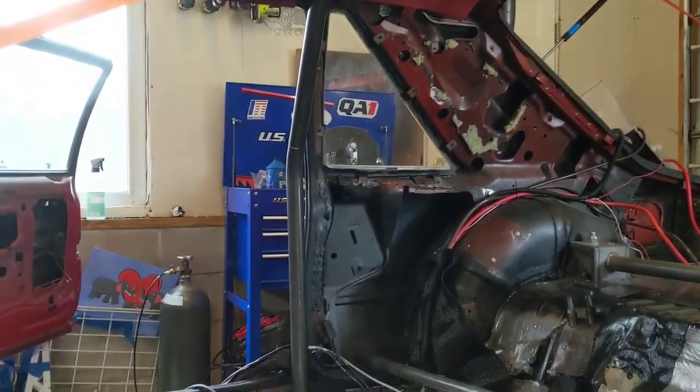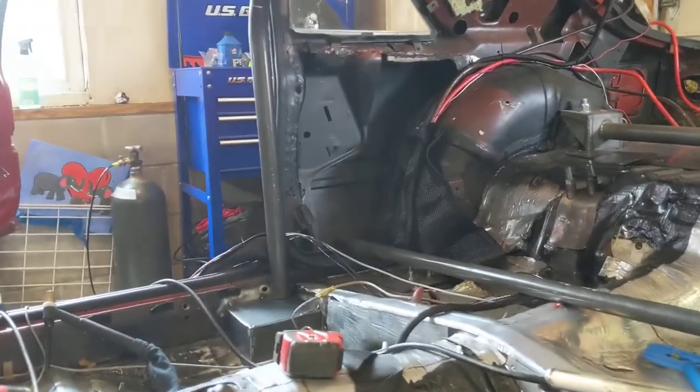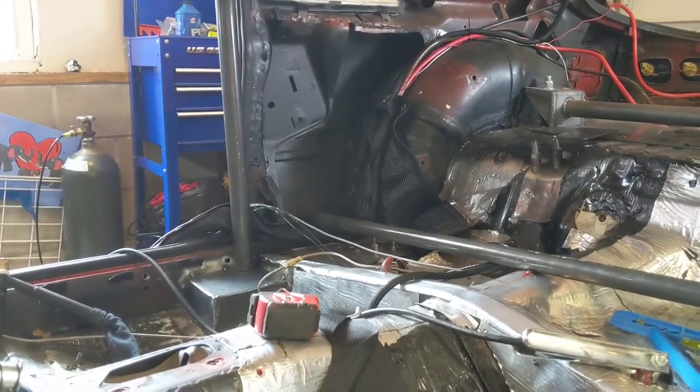After that, Team Z with the main hoop tells you where to cut it. The only thing with how they're telling you where to cut it is that they mark it out for one, if you're going to put the plates right on the floor, the 6x6 plates, or two, if you're welding it to through-frame, subframe connectors, through-floor, rather.